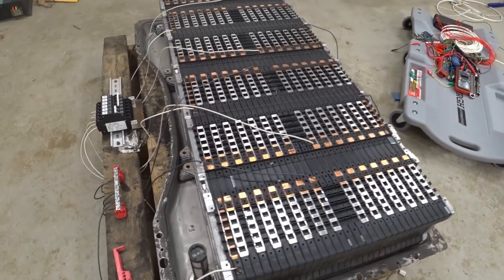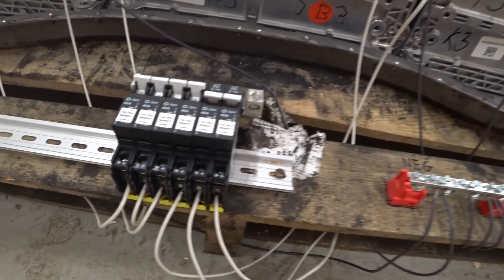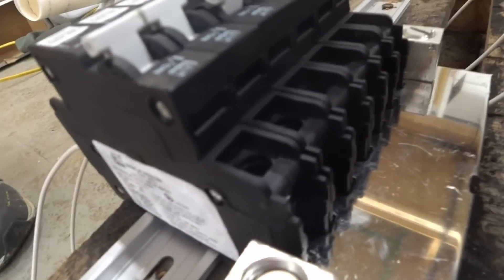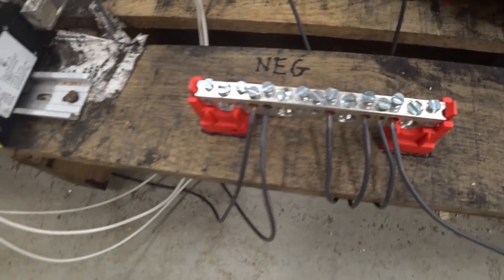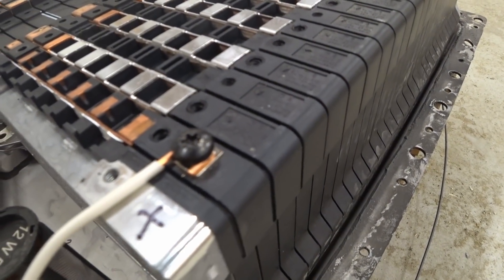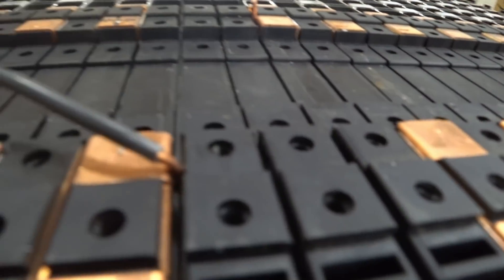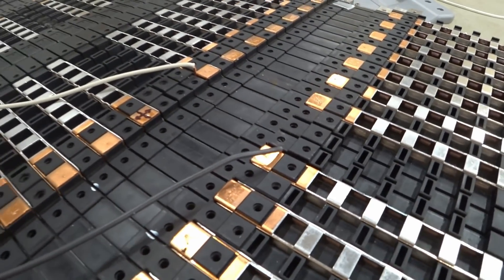Here you can see the batteries and how I've wired them up just temporarily so that I can do some of the charge and discharge cycles. We have all the wires coming down. The positive wires are going to this set of circuit breakers where there's a bus bar in the back. That bus bar has all these little fingers that fit into the terminal slots. All the negatives are actually run over here — just ignore that it's red plastic, it's the only bus bar that I had. This is how I was able to parallel them and hook them up to the DC-to-DC buck converters and boost converters. I obviously cannot do that long term, so let's take this apart and put on a proper solid connection.